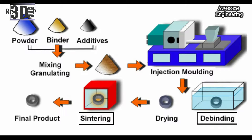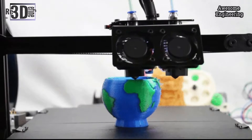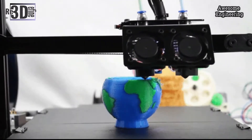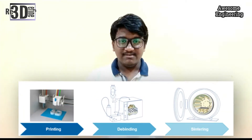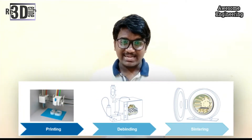The final 3D printed part is 316L stainless steel. FFF refers to a 3D printing process in which parts are built up layer by layer from a moldable material, originally limited to thermoplastics. Ultrafuse 316L, a metal filament with a polymer content, uses the same process. First, a suitable 3D printer builds a part layer by layer with the polymer content of the filament acting as a binder.